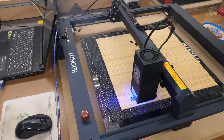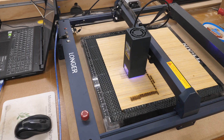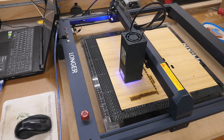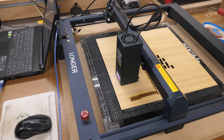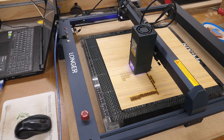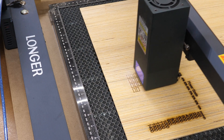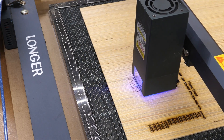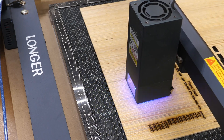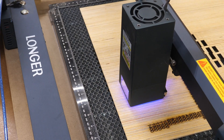Yes, I do have the doors open, so yes it makes smoke. This test grid can be used for any material, not just eighth inch plywood — you can use it on anything if you're going to be doing cutting. Generally if you're going to have a higher powered laser like this, you're in it for the cutting, not the engraving. Run time on this little grid is about 12 minutes. I do see I need to back off the power a little bit for the text on the top and sides because it almost burned all the way through on this eighth inch plywood.